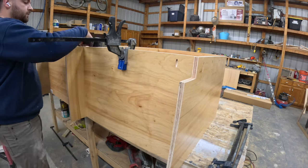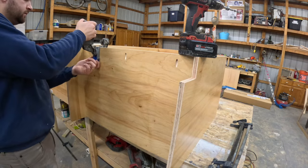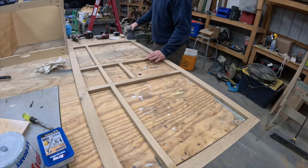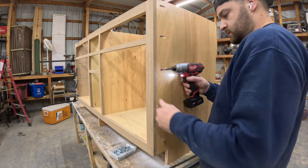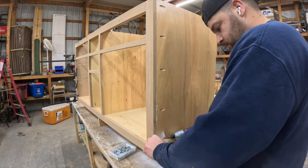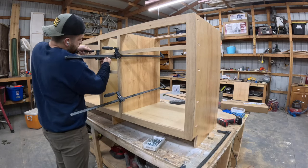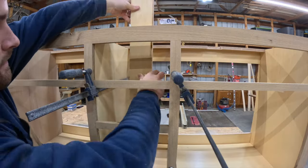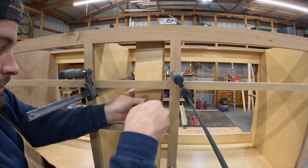The side that didn't get pocket holes I simply glued and put clamps on overnight. After a quick sand, I set the cabinet on its back and positioned the face frame exactly where I wanted it and sunk in a couple screws. There are some spots without pocket holes, like along the drawers, so I just added some clamps until the glue dried. While we're waiting on the face frame to dry, we can start the process of mounting all of the drawer slides.